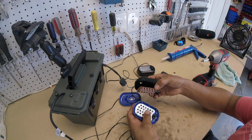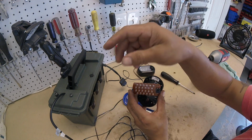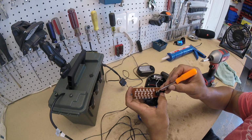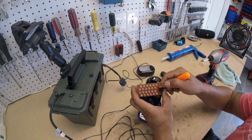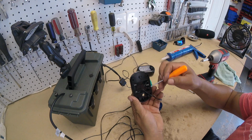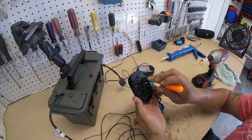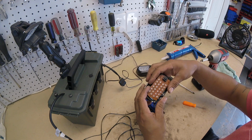And as you can see, here are the LEDs. Now all I did was get these, let me get this to help show you. These 2 leads right here, which are on the bottom of this. All I did was add some copper wire and I soldered them together. That's all I did. The switch is on, and soldered them up, and then I took these wires, which I added myself. Right here is your negative, so I soldered one lead to the negative, and then on my positive side I went ahead and did the same, soldered onto a positive, and then I simply put it back together.